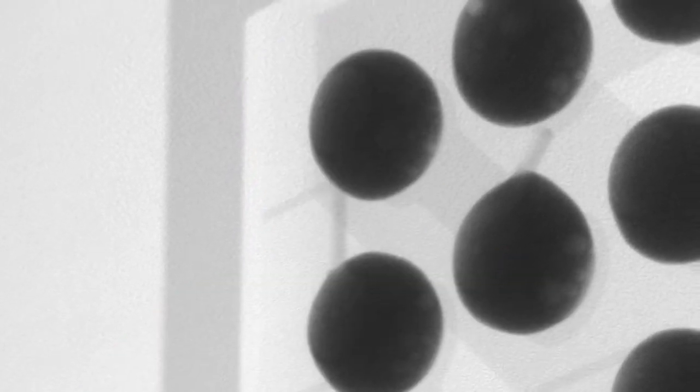Now again, X-ray as a technique is extremely valuable because we can obviously look for the obvious faults like short circuits. We can look for poor wetting, open circuits, and with wetting indicators we can see the degree of wetting which is present, but that's designed into the design from the start. So you have to consider this right at concept stage.